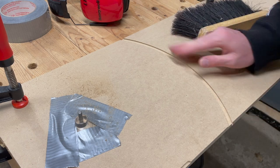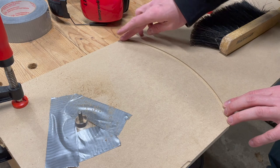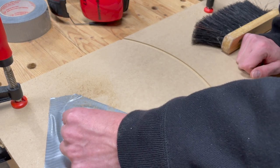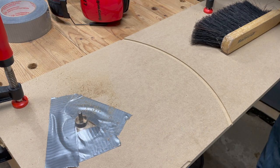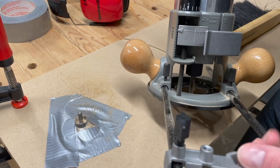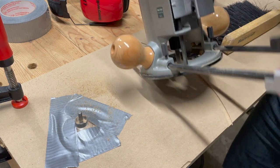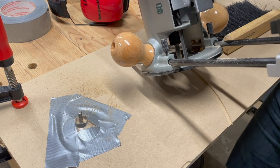We swept it out and generally that's a pretty nice arc. Not sure what diameter or radius I set this to — it was just a random setting to try it out using that half-inch straight bit — but very stable. The pin itself held really well with the tape. Maybe a tiny bit of give, so I'd probably tape it down a little more next time. The jig itself held up pretty well. It's not necessarily as good as a Miles Craft circle jig I had a few years ago, but to have this built into the edge guide I got for this router system is fantastic.